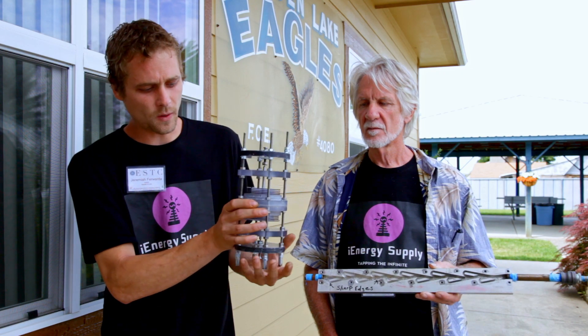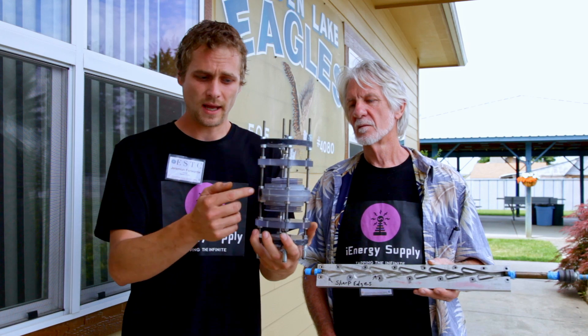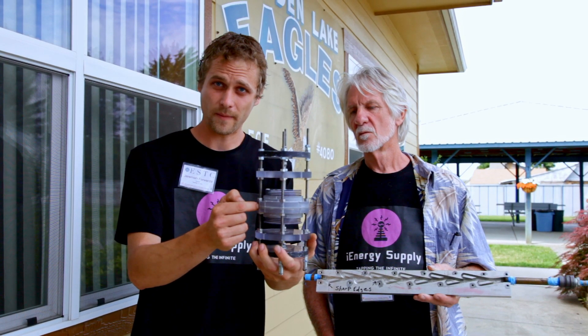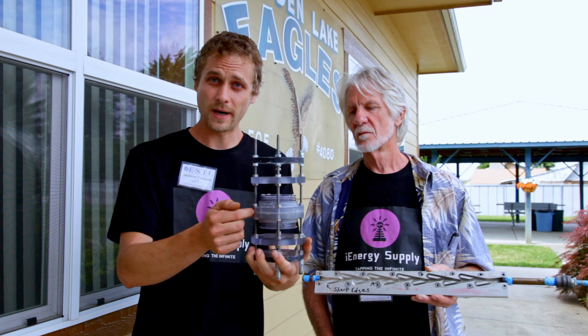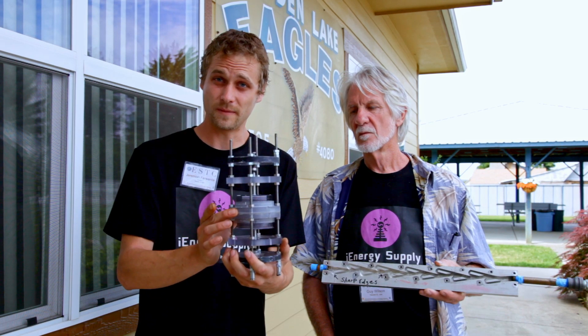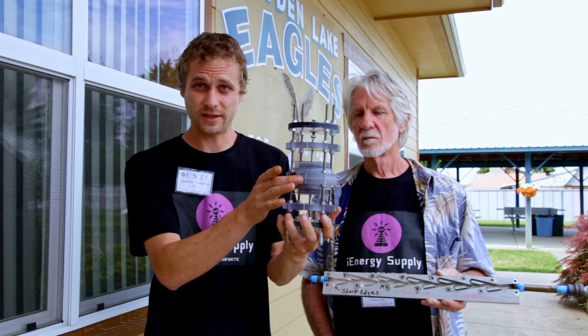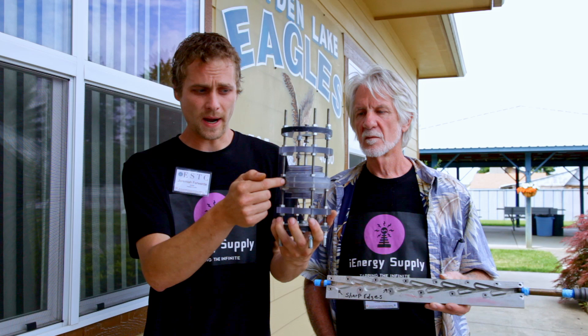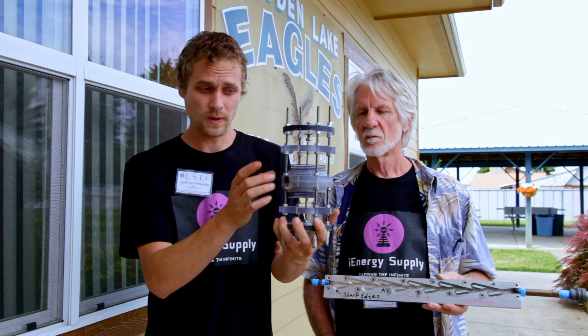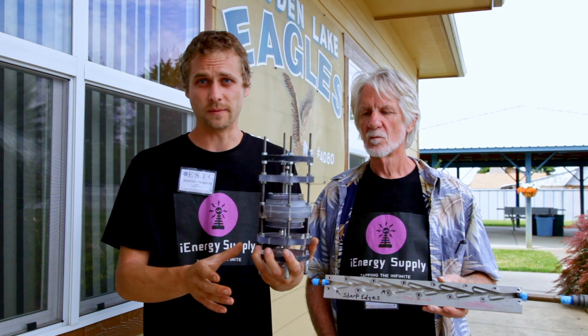So you actually get a lower pressure inside of the turbine when you rotate the shaft, and that draws in ambient air because of the lower pressure. The ambient air can actually assist the rotation of the turbine, and because stage two is attached directly to the shaft, the power is transferred into stage two to power this centrifugal force to remove the back pressure from the turbine.